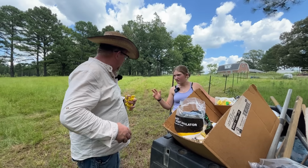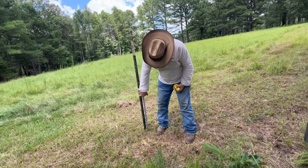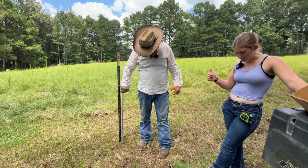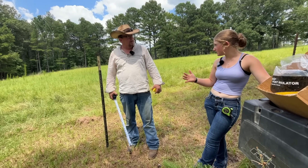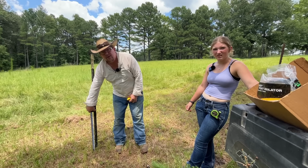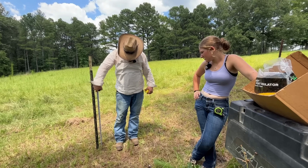So how far up do you want to do them? Let's do... Probably where your 6 is at. What do we do down there? 6, 8, 8, 12. Hold on. You have the one at the bottom, and then you have 6, 8, 8, 8, 12. It's 6 strands. How high is the one at the bottom up? I want to say it's like 4 inches. Do you think 6 inches is close enough to the ground to keep the goats from trying to go under an electric wire? Maybe. All right, we're gonna go 6. We're gonna cut down on our number of strands.